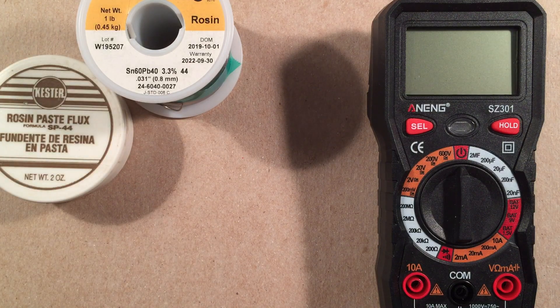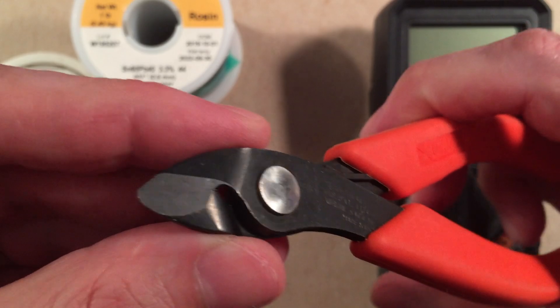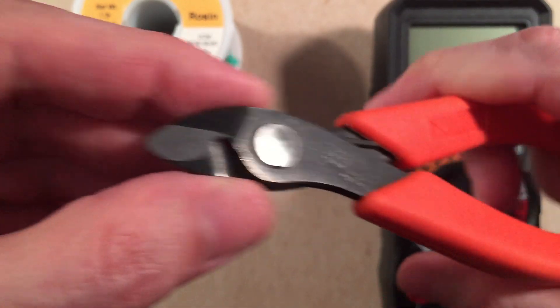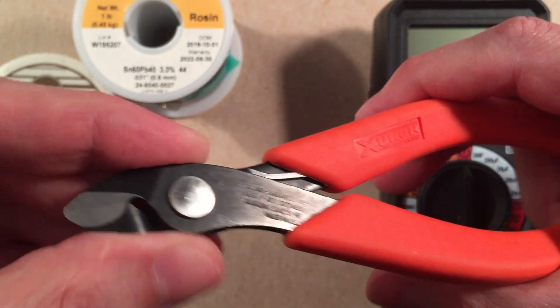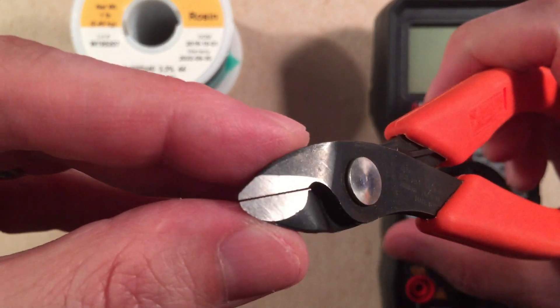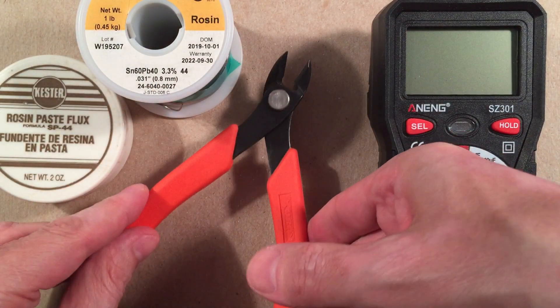And of course, speaking of solder — solder if you're in England, solder if you're in the U.S., because we rebelled. I did some history on the word. This is the 60/40 — I like to use this kind. It's a tin-lead based, and yeah, it works pretty good. I don't like the lead-free stuff — it just doesn't melt, the melting temperature is too high, and I like a lower melting temp. And then we have some awesome flush cutters. They're nice flush cutters to cut the component legs off — you don't want to leave them hanging, they look ugly. These are Xuron cutters, made in the U.S.A. Just cut soft component legs — don't use these to cut battery terminals or anything hardwire, you'll wreck them. These will last you for years.